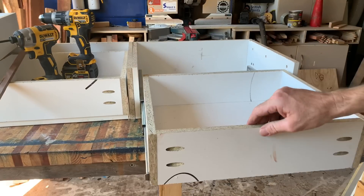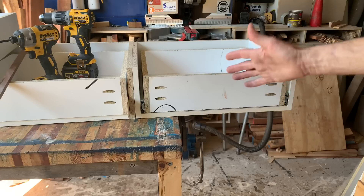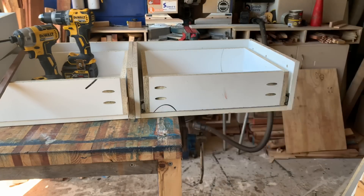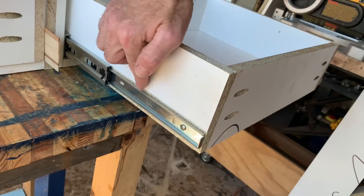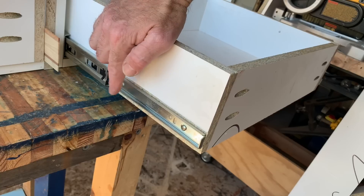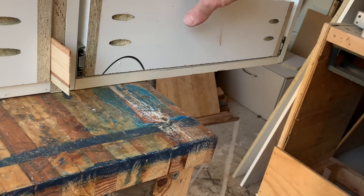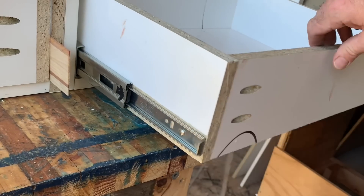This is take two — take three — on the soft close. It's not perfect. What I've done is made them too tight. Just on this one side I've run the whole drawer through the table saw and taken off less than a millimetre, just so that slide sits in. And that was just enough to let these drawers slide a bit nicer. Good enough for me.